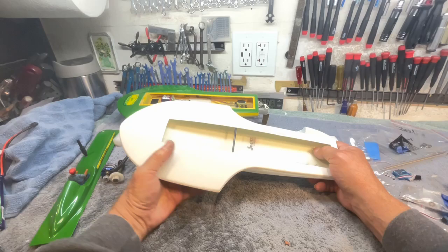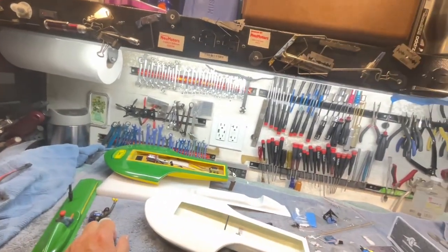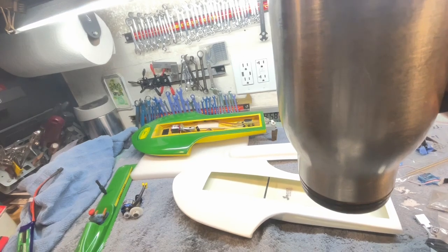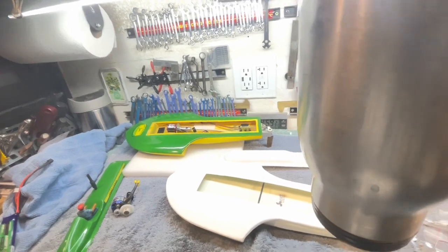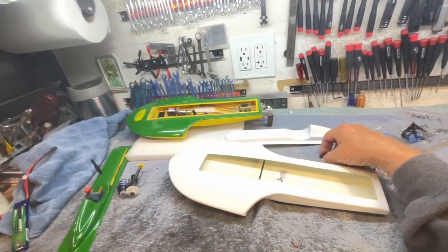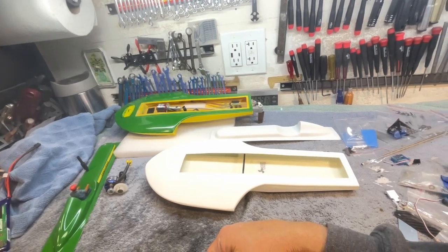So I'm looking at about 100 to 150 watts. So that's what I'm thinking. An even smaller motor. I was originally thinking a 707 motor, but a 705 motor is 12, 13, 14 grams lighter. So there's 12, 13, 14 grams right there. So I may go with an even smaller motor, a higher gear ratio, and a stupid high kV, something in the 8,000 range.